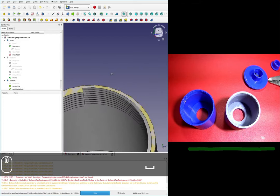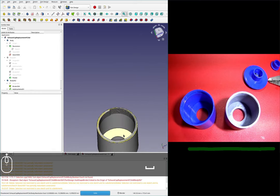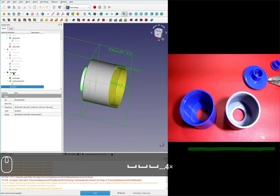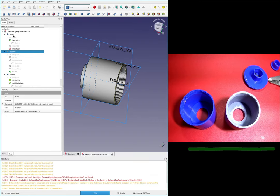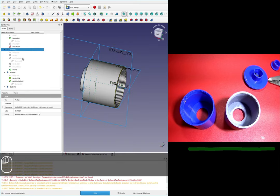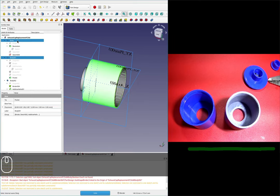Let's bring back the original body and it's looking good. Coming down, the chamfer cut is also looking pretty good. I'll call this section complete and switch over to try the booleans with part design — we'll try boolean operations in part design and if it's not working out then we'll switch over to part. I'll select body, make it the active body, and do a boolean on body 001.